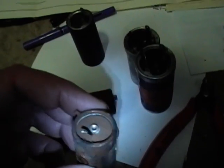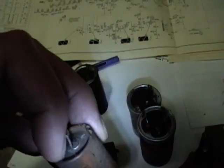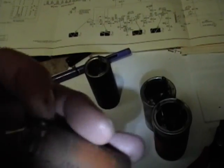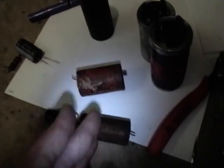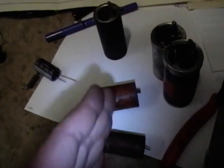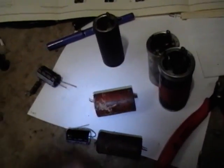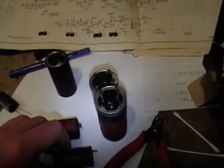I haven't done too many of these. I've never been able to do it without mangling them, because these are cardboard covers and if you try to unroll the ends the cardboard starts to fall apart — in fact on both of these it already is. So my thought was maybe to just cut them with a fine thin hacksaw blade, cut them right in half, pull out the insides, put the new cap inside, glue it back together, and when you put it in the clamp the cut won't be too noticeable. Maybe I'll cut it closer to one end so where the clamp fits there'll be more structural integrity.